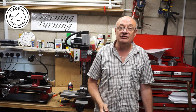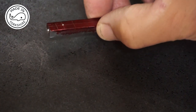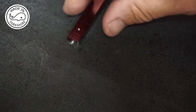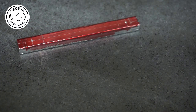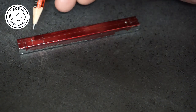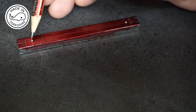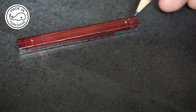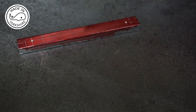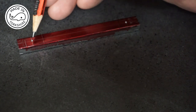Let's see how we get on. This is a piece of mild steel bar which will be used to make the conrod. I've already faced both ends using a four-jaw chuck on the lathe and put a little centre hole on each side. Tubal Cain suggests that rather than reaming the hole to 3/16 of an inch in diameter, you actually ream it to a quarter of an inch and put a bush in there, and that's what I'm going to do. The smaller hole is going to be reamed to 3/32 of an inch. I've done some basic marking out as per the plan and centre-popped where the holes will be drilled.